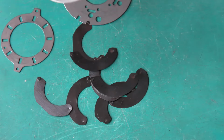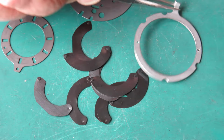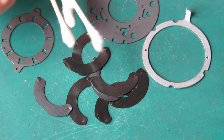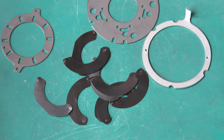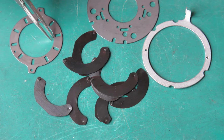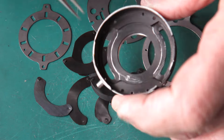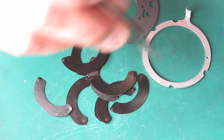And the setting lever, and got all the old grease and rubbish off those. You can see from the state of these, that grimy look. Should put in the shade a bit, you might be able to see. A lot of grime came off those, particularly the setting ring. The ring here that turns and brings the blades in and out, and in a case. There was a lot of grease in there, dark coloured, very dry. That was causing our problem, I would say.